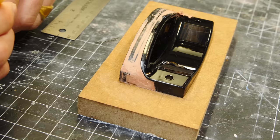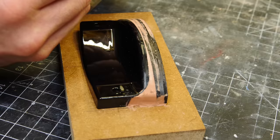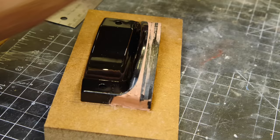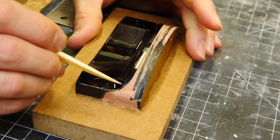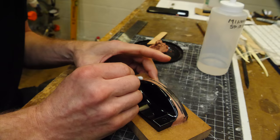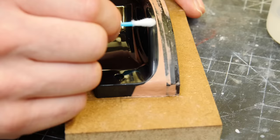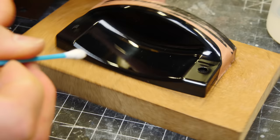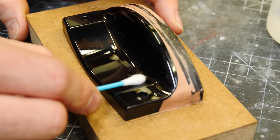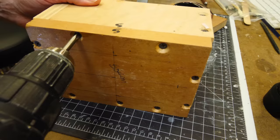It's important that you use a non-sulfur based clay so that the silicone can cure inside the mold. The last thing you want is to do all this work and then not have your silicone set up because of problems with the clay. The nice thing about this clay is that you can clean it with mineral spirits — I can use a Q-tip and some mineral spirits to get a really nice edge against the clay, then polish the part, and we're almost ready to put it inside our mold box.